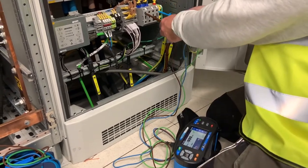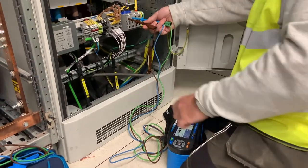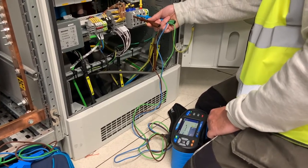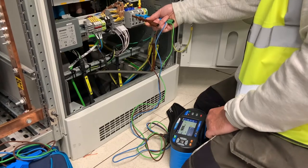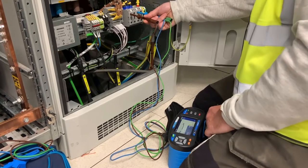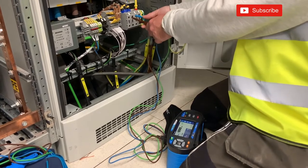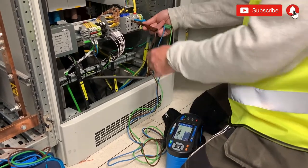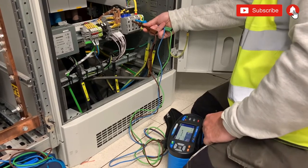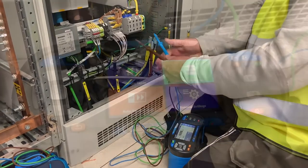As we need to send a clearance document for this to be connected with a live supply, we need to do a certification run. Before we do that we will just check between each phase and between each phase to earth. So we've done L1 to L2, now doing L1 to L3, and finally L2 to L3. At 500 volts it's showing that each of the connections are not connected together or down to earth.